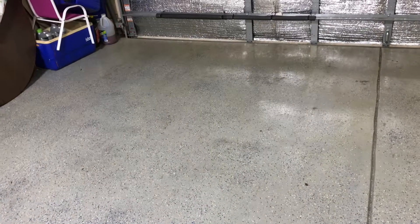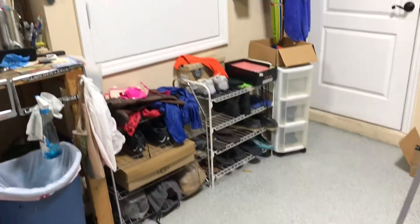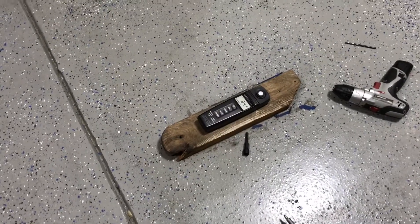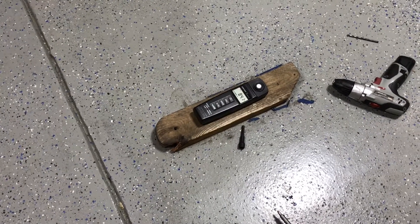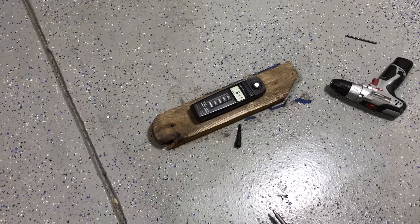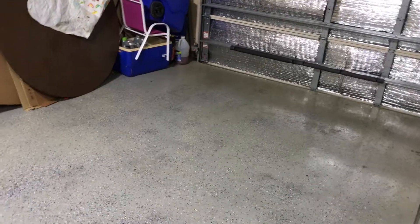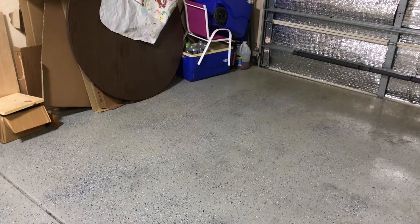The next test: with lenses off, I used the two side rotating bars and rotated them to shine more light toward the inside of the garage and toward the door and my workbench. When working on a car with the hood up, it's actually better because the light bounces off the white door and reflects back. On the ground I'm back to about 84 foot candles with the lenses off, but I'm distributing light over to the bench — if the car is backed up and the hood is partway up, the light shines right in. Pretty good design.